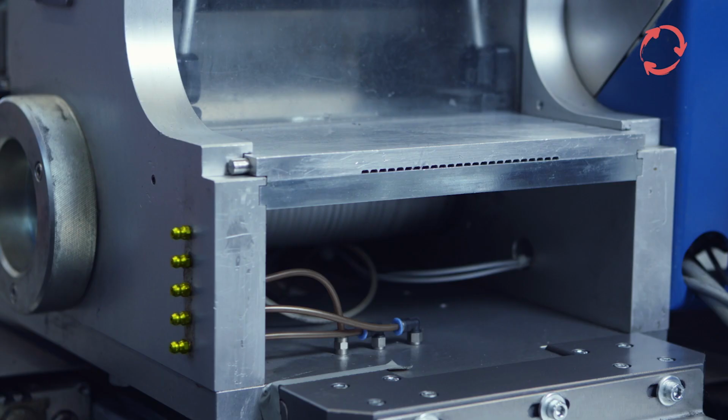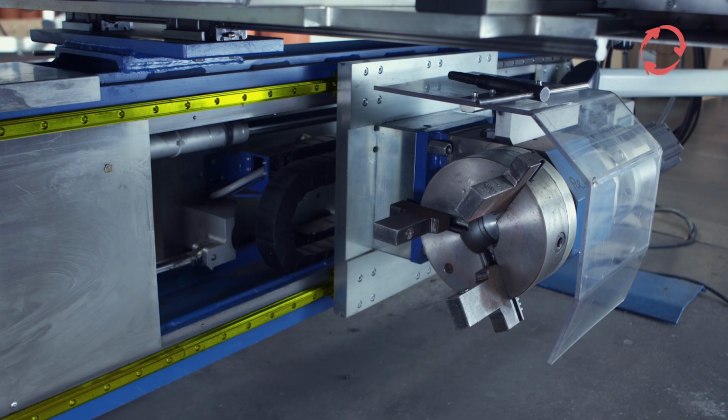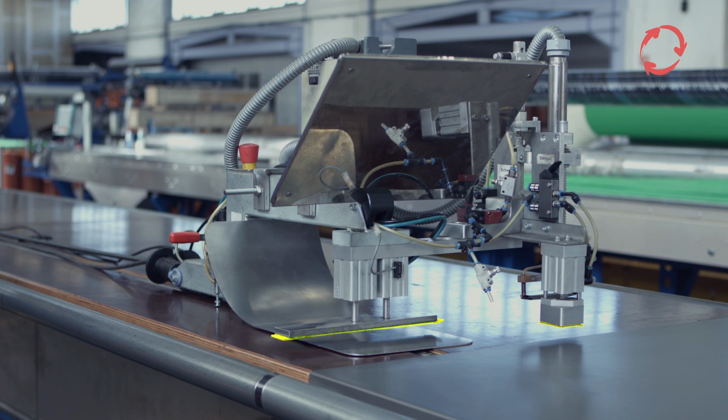In order to ensure error-free operation and machine safety, the following maintenance operation must be performed regularly. Check the drive unit and lubricate the grease nipples with fluid grease. If the filler wires feed unevenly, check the rubber roller above and replace it if necessary. Check cover guides on the bearing units for firmness and tighten the screws if necessary. Finally, check the foam rubber pads on the hold-down clamps and replace them if they are worn out.